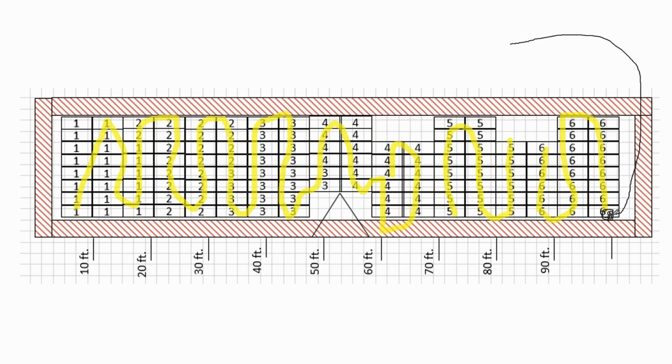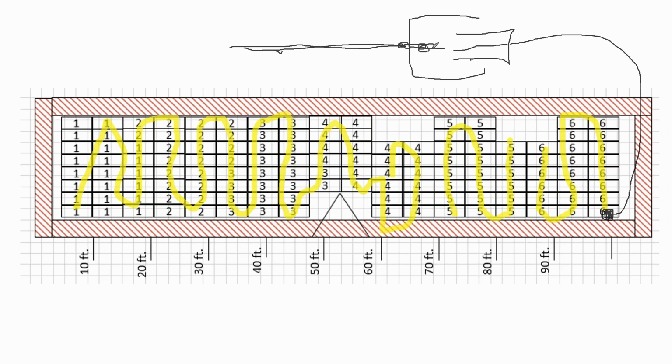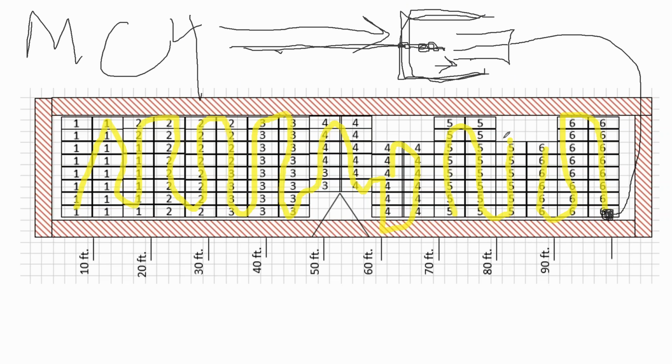Because this connector is a standard format called an MC4 connector, which is a housing that has a male and a female end that's protected by a housing. And so you take your single conductor cable and you crimp on a metal attachment, and then you screw on a housing for it, and they click together. MC4 is the name of the standard connector, but it's made by a variety of manufacturers, and there is a subtle quality difference between the MC4 connector that costs like 60 cents and the MC4 connector that costs $1. You have your single conductor cable, and then you have a metal connector that you're crimping onto it, and this metal connector could be U-shaped that gets crimped, or it could be a complete circle that gets crimped.